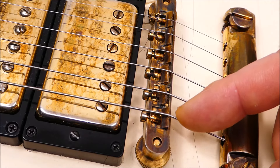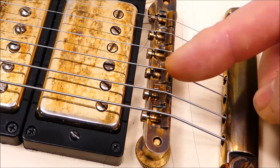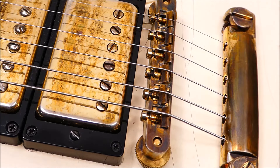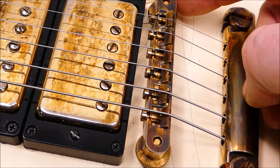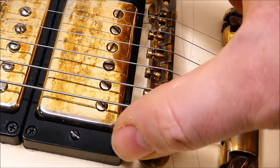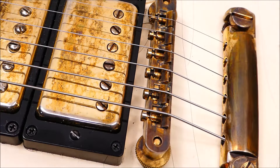So what do we do in a case like this? I could pull out the studs, plug the holes, re-drill, and move them about a sixteenth of an inch — essentially the diameter of the stud — drilling right through the same glue line. That would put the saddles closer to the center, but pretty much just for cosmetics. It's lived and played for 60 years in this configuration. It's playing in tune, and I'm kind of in a mind to leave it like this, if only to prove that some of them were made this way. Dan Erlewine, on a StewMac video, shows a hack using a second set of thumb adjustment wheels — he drills an offset hole, puts a second stud through, and they act like little cams so you can swing the bridge back the requisite amount. But in this case we don't need to. It just looks a little weird. It's fine.